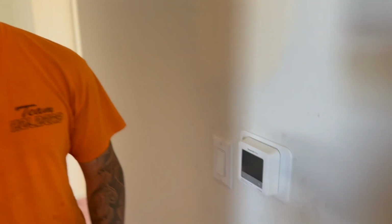First of all, indoor air quality and what you're going to be putting into this home to make sure that your family's air quality is the best it can be. So it is an upgrade. It does not automatically come with the Daikin Fit, but it's a great air purification device that will be installed inside the air handler in the attic, inside the ductwork. So when the unit is on and moving, it's going through that air purification device and helping get rid of all the dust and pollen, and it has an ultraviolet light that will help kill viruses, mildew, mold, bacteria, those types of things.